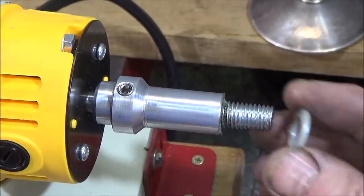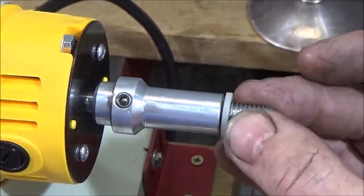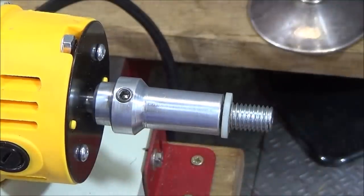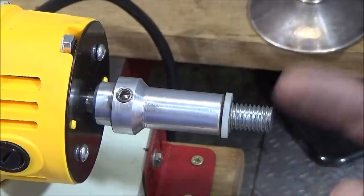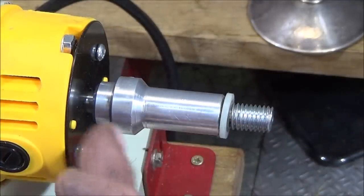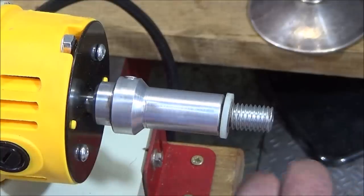And then I just put a nylon 10mm washer on there so that when the adapter screws down onto that, I can actually unscrew it easily if I want to in the future. Or you can use a fibre one. The only thing when making these, make sure that you have it running as true as possible within a thou